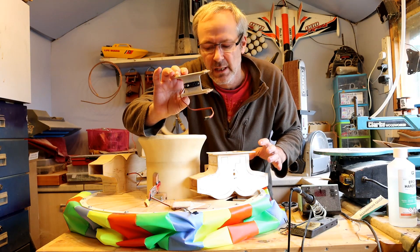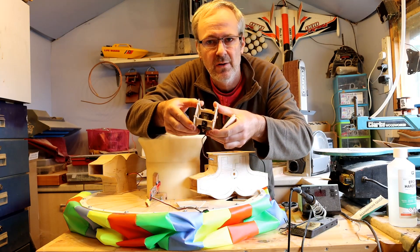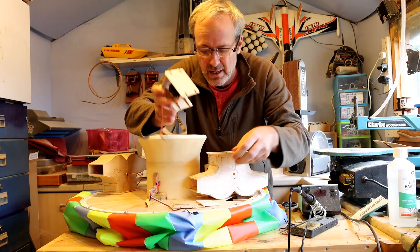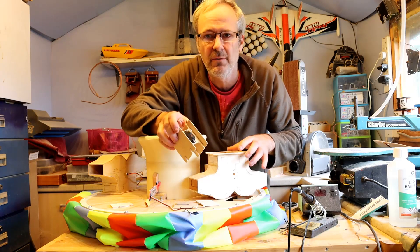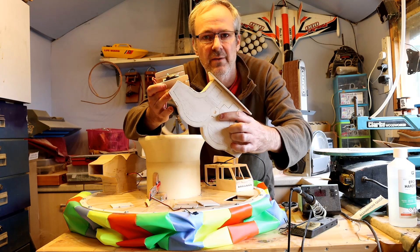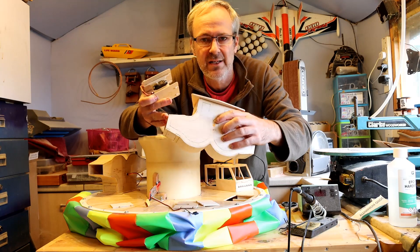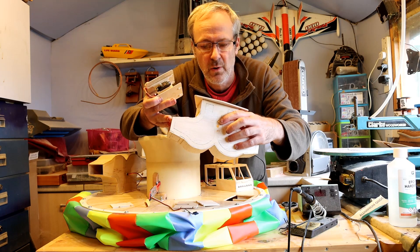You can see I've built this one up. I've made a little jig because you don't want it to set skewed — just put that bit of wood in there to keep it nice and square. The next job is to put this into its housing. On this side I've got the holes already pre-drilled for the servo horn. The next thing is to glue the servo horn in there, but before I can do that I need to countersink these two holes and cut two little countersink screws to hold the horn in place.